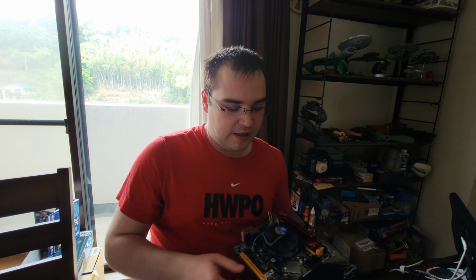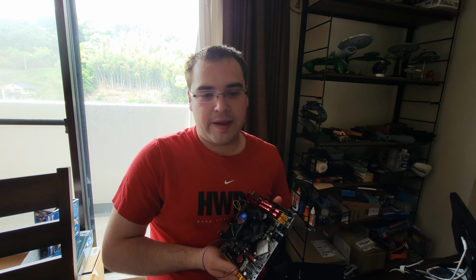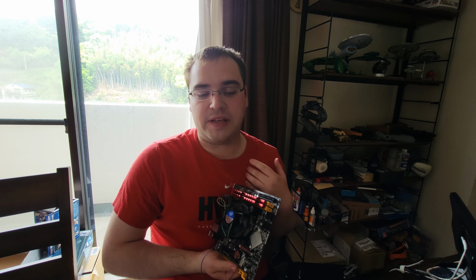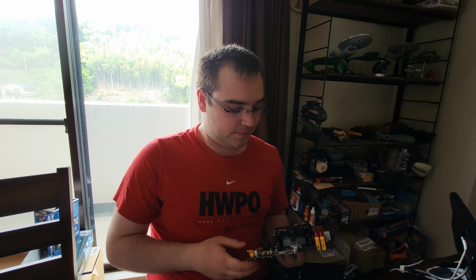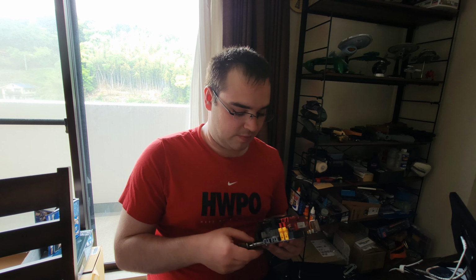But there was one thing that I could try, and that is the good old-fashioned bake it in the oven method. And I know a lot of people look down on that, but this is really just for my learning and entertainment. And honestly, I want to see if maybe there's some solder somewhere that needs to be reballed.